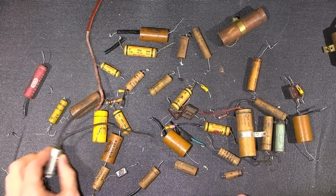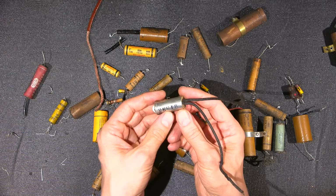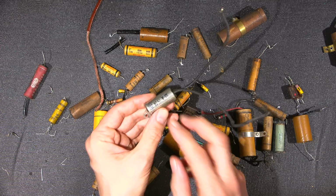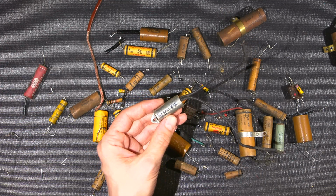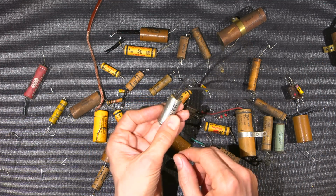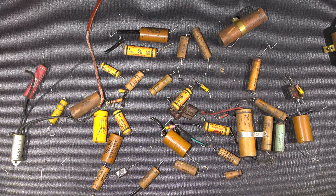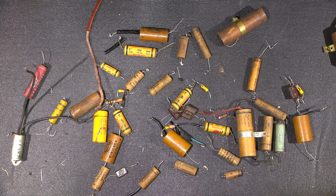I'll get a schematic in the shot, and we'll test the famous death capacitor as well. So this is the capacitor that's across the AC line and tied to the chassis. Now these capacitors, it's a pretty strong term, they call them the death caps. But really what happens with these things is they end up short or becoming electrically leaky, and they bring the AC line onto the radio chassis. So this is that capacitor in that radio. We'll test this as well, and we'll see exactly what's gone wrong in here, and I'll explain all about all of these components here. So I'll go grab a schematic and some tools here, and I'll talk about that, and then I'll grab the radio chassis, and I'll tell you where I've replaced things and why I've done it like that.